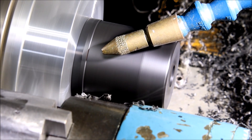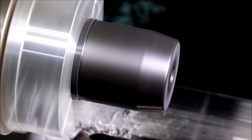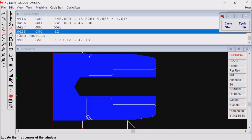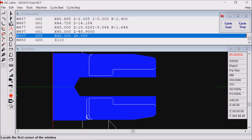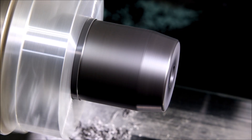Here you can see the air blast is bouncing off the chuck and getting rid of the swarf quite nicely. You'll notice that after the roughing cut the tool appears to go home and come back again, but in fact it didn't do that on the machine — all I'd done was change the G50 to give me an X offset because I couldn't be bothered writing a whole new tool path for just a small cut.